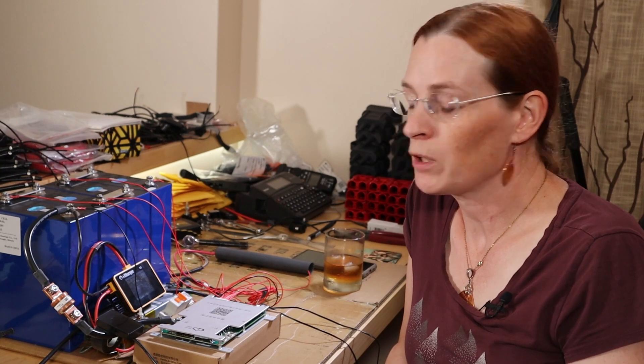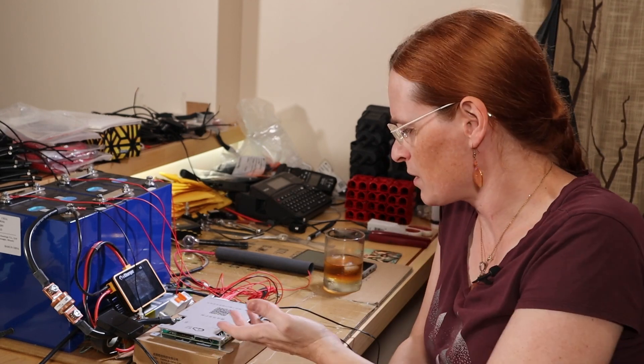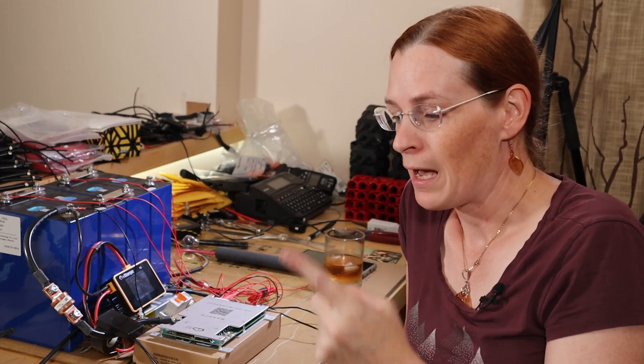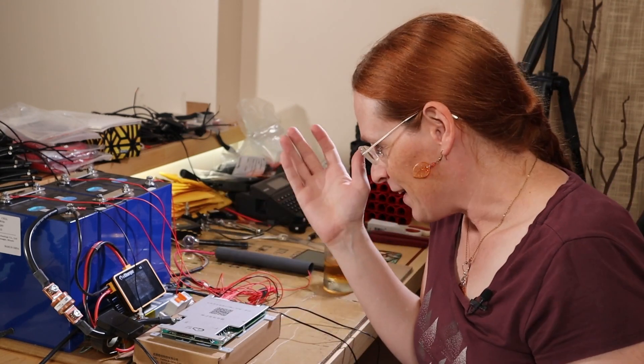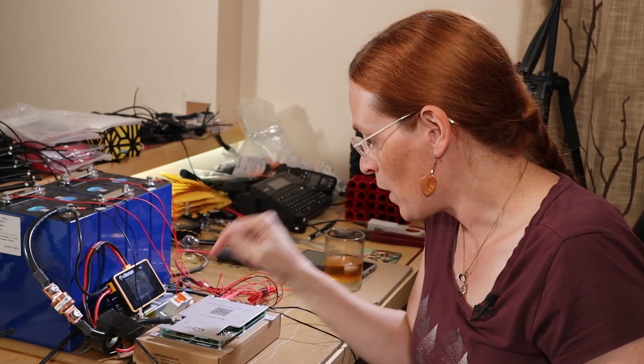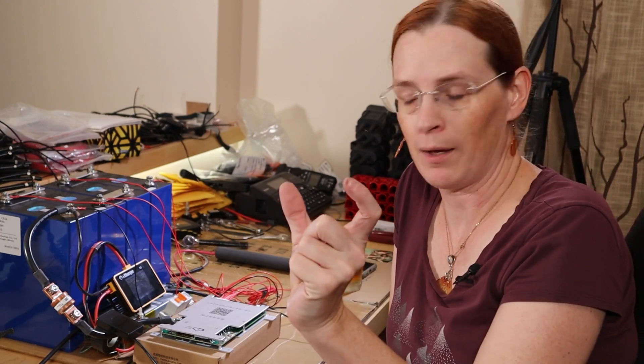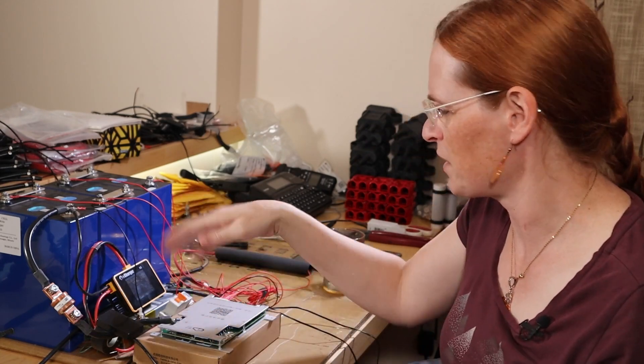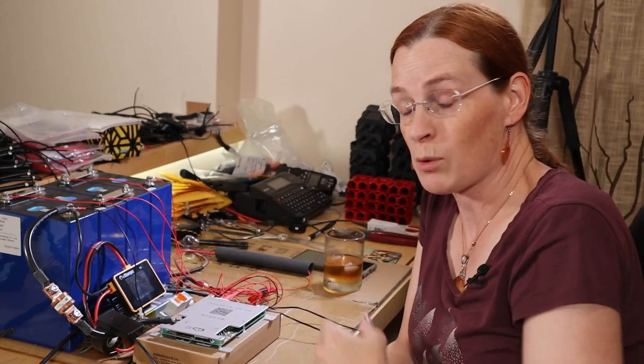One of the messages I got was: if it had the H suffix for the heater, that would have been 4S and 8S. How does that relate to the fact that this doesn't support 4S? Change the part number. That said, I fully accept the fact that I completely dumb-assed on this — turned off the breaker, didn't turn it back on. It does work in a 4S configuration with an external power supply. If you get a little buck or boost converter that can step the voltage up — I'm guessing it's probably 20 volts, but 25 volts is what I've got here and it works. I've already got the replacements on order, and I wouldn't do this in the boat anyway. I made a mistake, and thank you to the people who caught it and called me out on it.